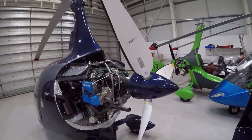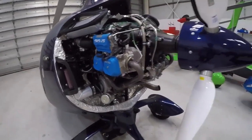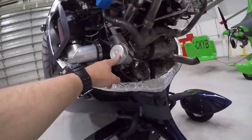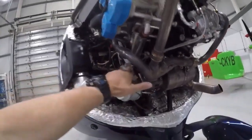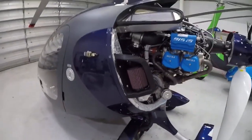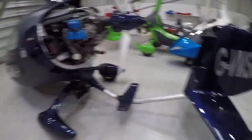Over on the left side of the motor, again you can see additional coolers on top, which are well packaged. Down here we've got the wastegate for the turbo on the exhaust side, then the exhaust side and intake side for the turbo, and the air filter or air cleaner for the intake side of the turbo.